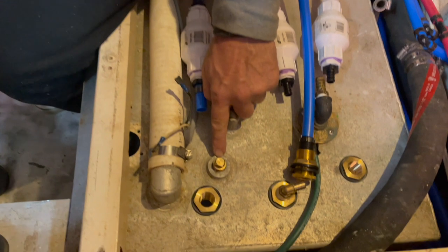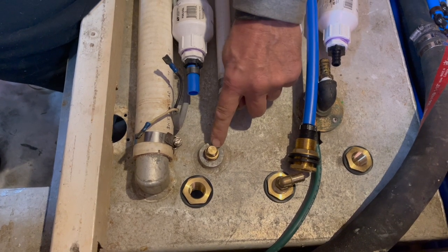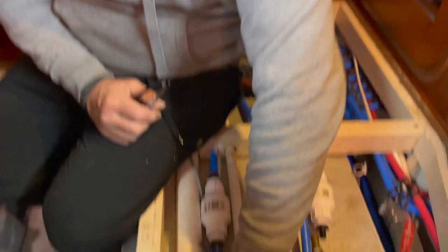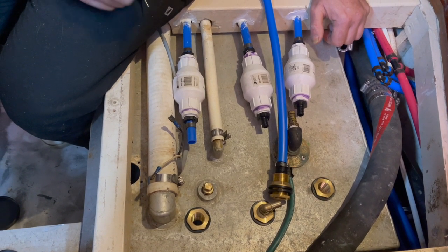When this boat was made in Taiwan, all the parts — like for the plumbing — everything was from England. So the through-hulls and a lot of the fittings they use are English-style fittings — I think they're called Royal Fittings or something. The threading is different, so it's a pain. An American fitting will go in but it'll just strip down into it — they're off just by a hair. So that's an issue to watch out for.